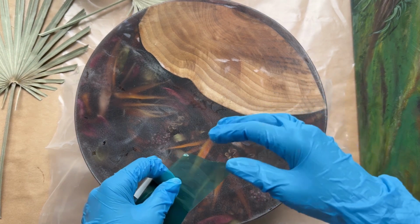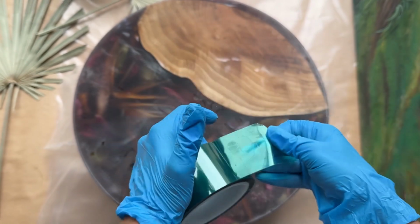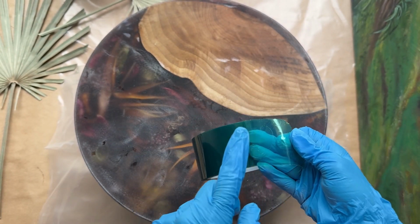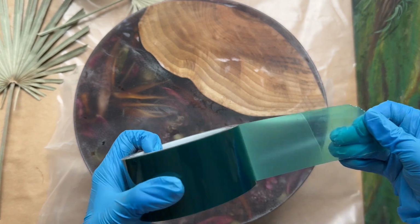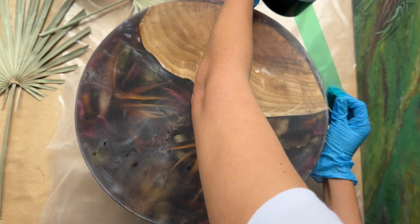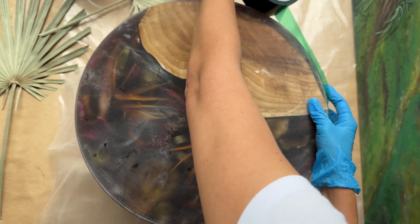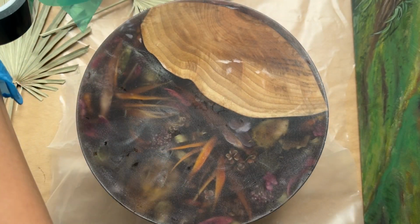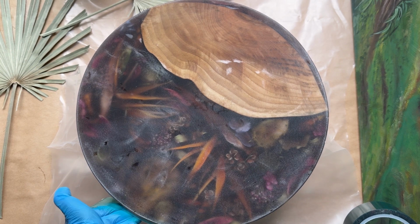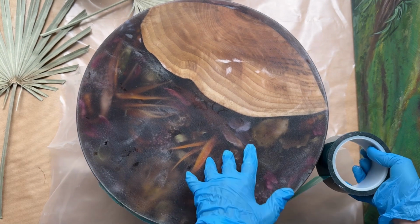Creating a tape wrap is a safer option. Grab some masking or reinforced tape, but not the regular kind. The regular tape won't stick. I have formwork tape. Tape it up, guys, to ensure it's easy to remove later, but also well adhered. The tape should naturally stick well. Give about a ½ centimeter edge.